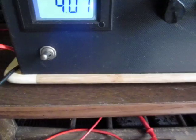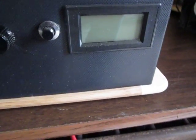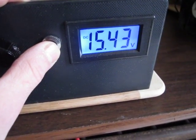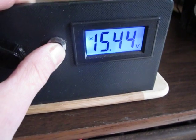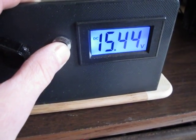It's just a good thing to have. On the output side, I don't like the idea of having anything connected permanently to the output which might interfere with the charging. So I added a switch so I can monitor the voltage across the charge battery, but it's not permanently hooked up. Right now it's reading 15.44 volts.